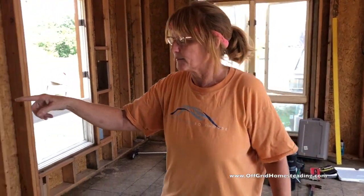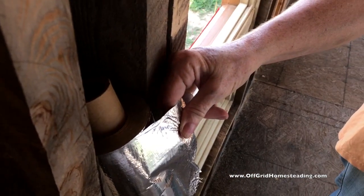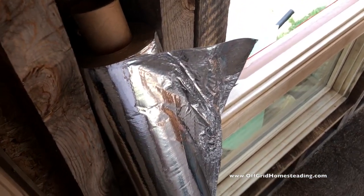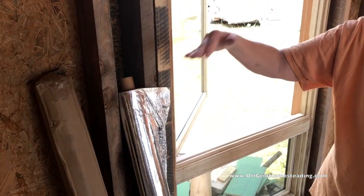What about the roof? He got the waterproofing up on the roof and put up vertical purlins. Now we're going to put up an insulative radiant barrier — a foil-sided radiant barrier with Mylar in it. We're going to do a double roof: there are purlins running vertically now, then we'll put this on and run purlins horizontally, so there's an air space both under and above the barrier.